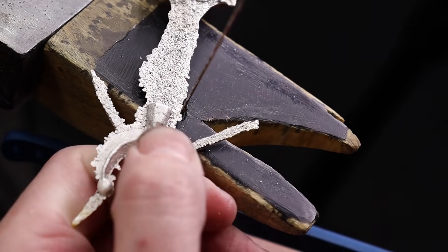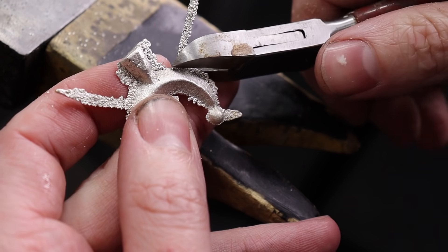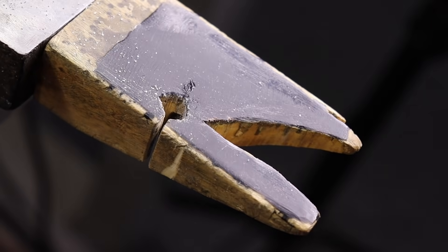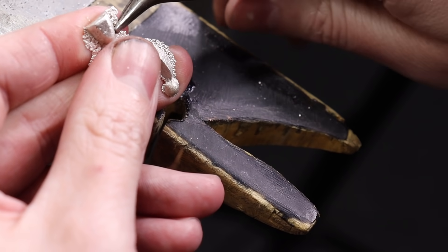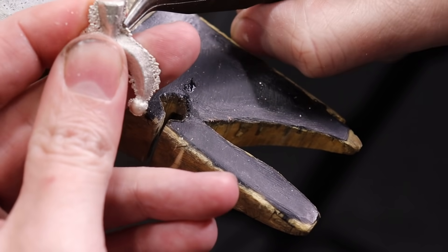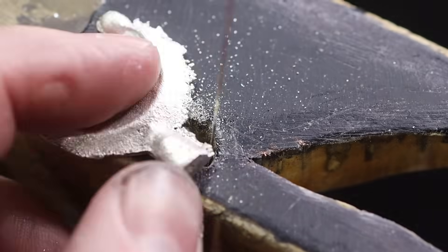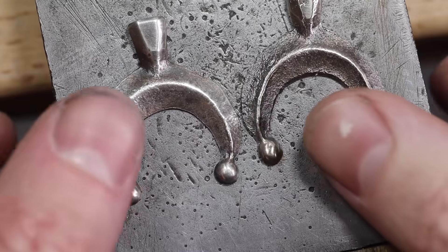For some other spots I'm just going to use some clippers and clip it off, or just break them off. I'm trying to keep as much of the silver as I can to reuse later, because you can remelt this and make more stuff. You can only remelt it so many times before it starts getting a little weird, because it gets inclusions of other stuff inside of it, and you need to start adding clean shot or clean metal of whatever you're using.